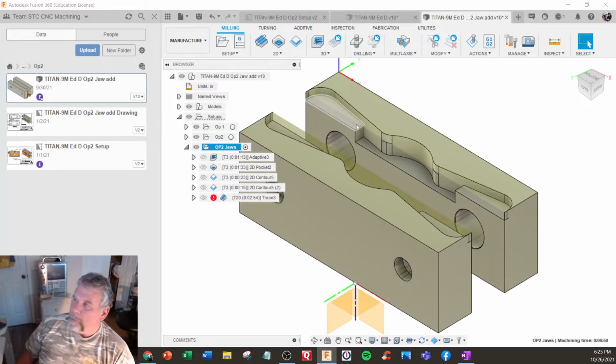You notice this step up here. This is holding it on the contour, and the flattest part of this part is actually these outlying areas. So this area is actually not going to touch. You don't want to have interference between here and here. You want to pick one or the other surface, because if you're slightly out of tolerance, it'll still work. If it's fighting each other, then you're going to have a problem holding the overall height dimension.